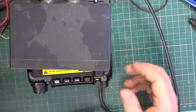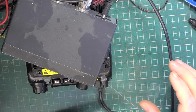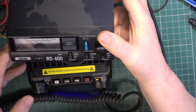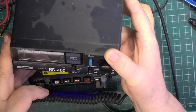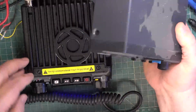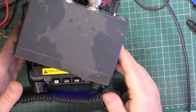That's what I wanted to show. Once again, we've got meters that lie — so put it on the 20 watt scale and it'll be well above. I thought you'd find that interesting because things that say they're a particular power clearly aren't. I can now trust that this meter is more or less accurate, because we've proved it between the Marconi test set and a radio of known power. I would say the first Chinese radio is just over 45 watts, and the TYT is nearer 40 watts. Thanks for watching.